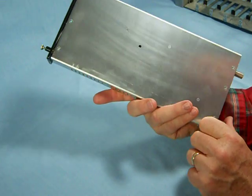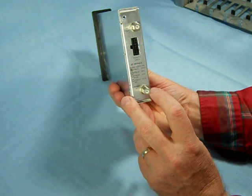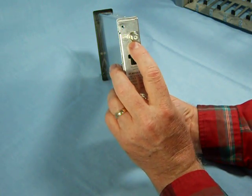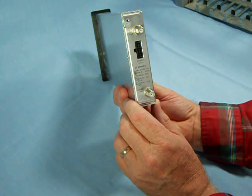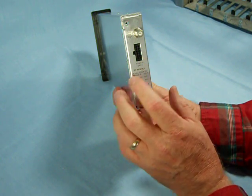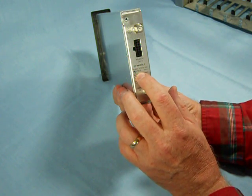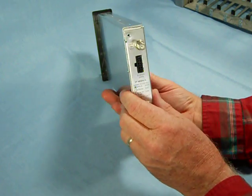There's not a lot to the box other than the fact that it has the L-band input here where your signal comes in, and your transcoded QAM RF out comes on this particular F connector. This is the keyed power and data input port. And here it indicates that this is a QTM 2, 6231A, as indicated previously.